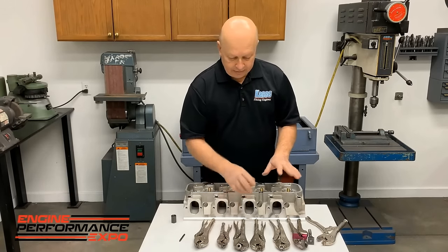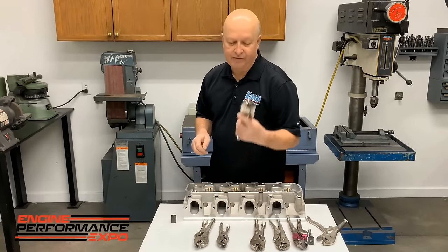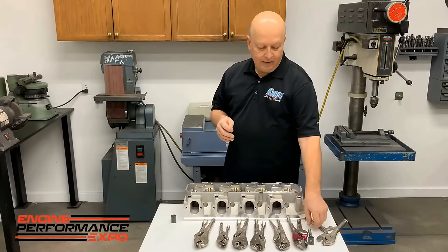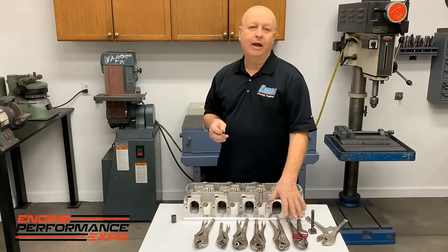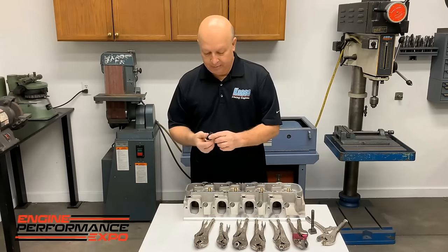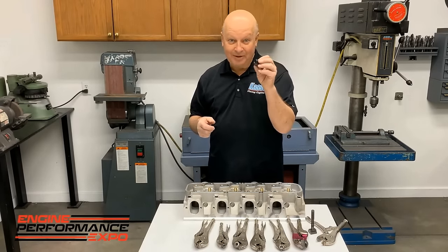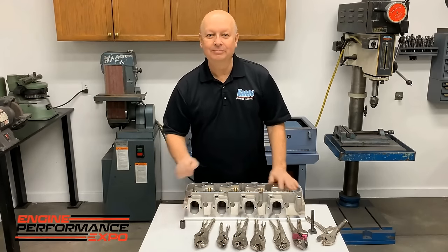But any of the ones you make, like for Chevy head studs, the 7/16-20, main studs, or half inch coarse for the bridge port, these things don't take half an hour to make. And I just love them. So I thought I'd start out with that. On the bridge port ones, this is a union nut that comes in those clamp kits, so you just grab one of those.